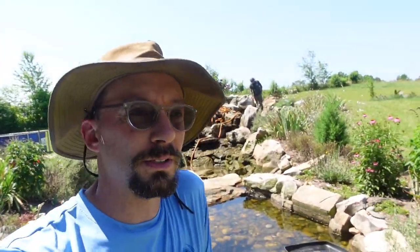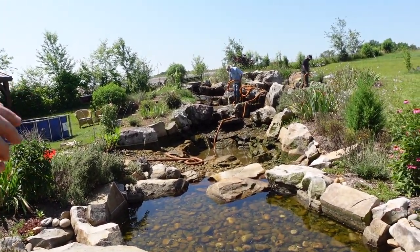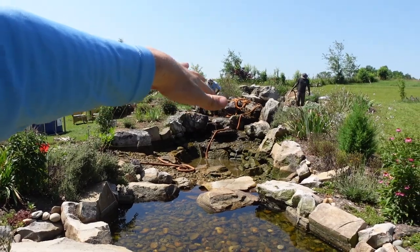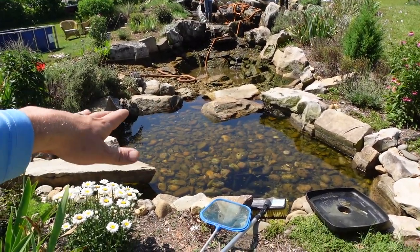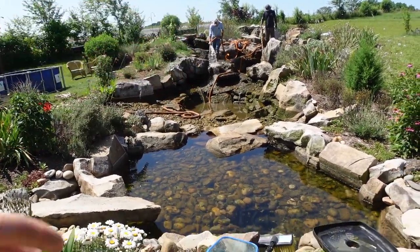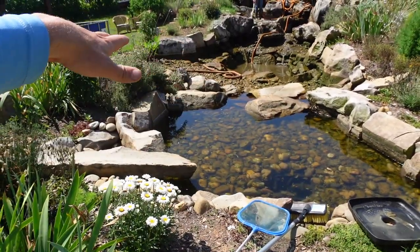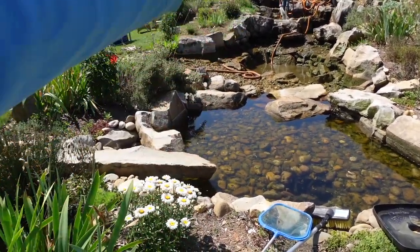We're in good shape here — just getting to the fun part, getting all that muck and sludge rinsed out. This pond is actually called a recreational pond, meaning you can swim in it. We designed it in 2018 for dogs and small children, so it's not very deep. The water was very clear thanks to the bog filtration, but there's a lot of sediment since it hasn't been cleaned in two to three years. The bog filtration breaks down muck and sludge and keeps the water clear, so we're basically just removing that top layer. Down here is an intake-based skimming system — when it's running, all debris and sediment that falls into the pond ends up here and can be easily removed with a net.